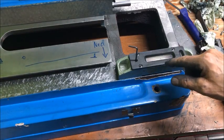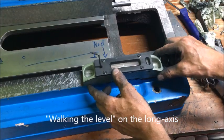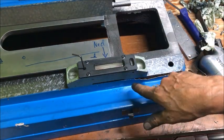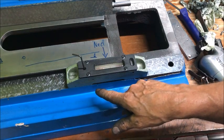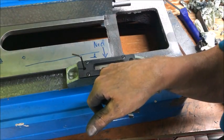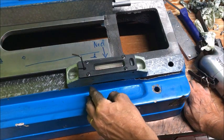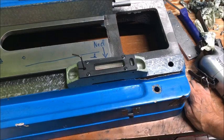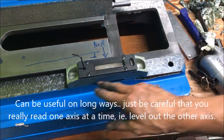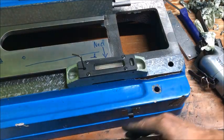I could also walk the level from this placement here, which I know is flat, and then set zero there, and then move upwards. The distance I have moved is 16 centimeters — call it 20 for simplicity — because this is at two hundredths level on one meter. This moved three marks, three lines, and this is one-fifth of a meter. So each mark would be about four thousandths, meaning it moved 1.2 hundredths of a millimeter up on that distance.